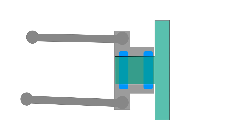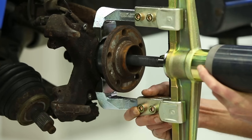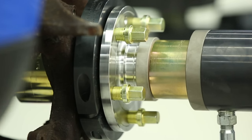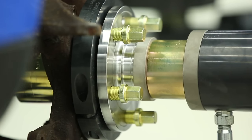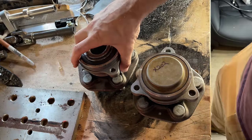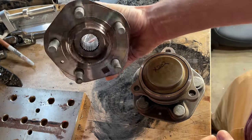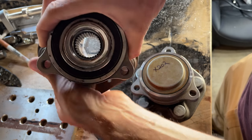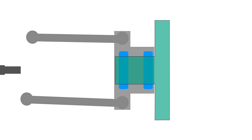Some later hubs were kind of the opposite of this. The flange that the tire mounts to had a spindle coming out of the back of it. The bearings ride on that, and the whole thing is pressed into the upright. You can service these bearings, but you need a hydraulic press and special tools with the correct diameter to make sure everything is square. A later generation of hubs bolt onto the upright instead of pressing into it, but the earlier ones would be held together with a little pressed-on sleeve, or sometimes just the inner bearing race. The only way to get the correct bearing preload on these is to use an axle nut — and if you don't have the axle bolted in and you go around a corner, the force could pull the hub apart, and you have a bad day.